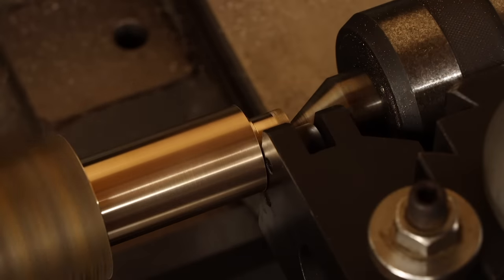I understand now why this is such a common project for machining apprentices. There are actually three ways to use this gauge: by using the ball end of the rod arm; by using the curved end of the base; and a third technique I didn't discover until just a day ago — a ball bearing resting against the chamfers of the arm pocket. Any one of these three techniques will let me theoretically measure squareness to a ten-thousandth over nine inches or so. You might be wondering what project I have in mind that will need that kind of accuracy — and I'll give you a hint. As always, thanks for watching and see you next time.